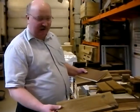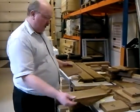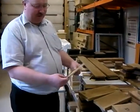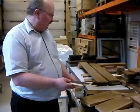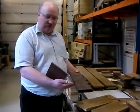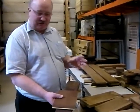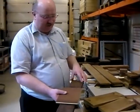Thermally modified wood is used for outside decking from both softwoods and hardwoods. Here we have some spools and samples, and another common application is flooring. It can be engineered flooring where only the top layer is treated, or solid flooring where the whole board is treated. With thermal modification for decking and flooring, we get very good dimensional stability and minimized shrinking and swelling.